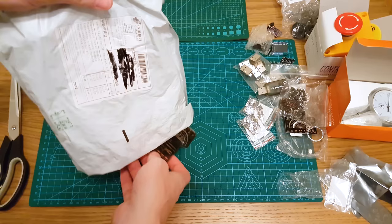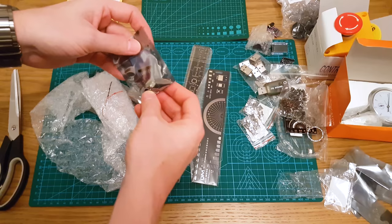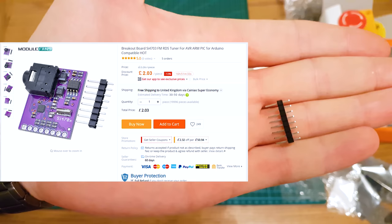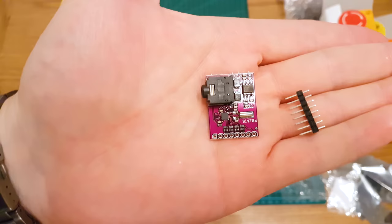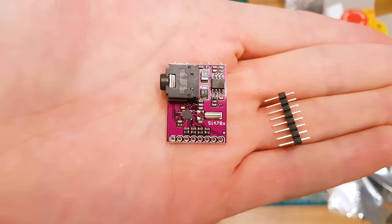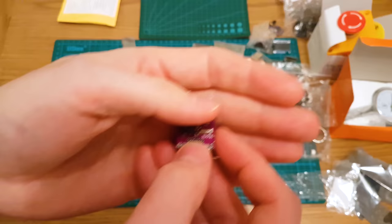Two engineer rulers — this will be exciting. One empty package. Two more rulers — let's get to them last. And this looks like an audio board. It's a SI470X — it's actually an FM receiver board, like a radio board. But compared to the other cheap ones on AliExpress, this is an FM receiver with RDS — Radio Data Service. This gives you things like the radio station name, song listing, and whatever additional data they send down the FM channel. If your car stereo shows who's playing and it's not DAB, that's basically what RDS is.